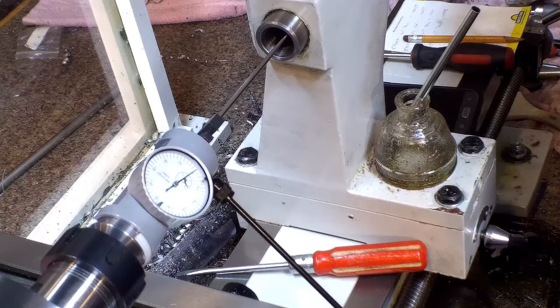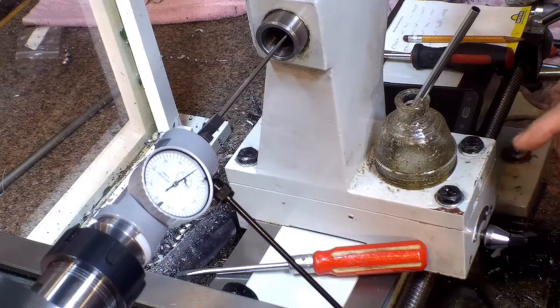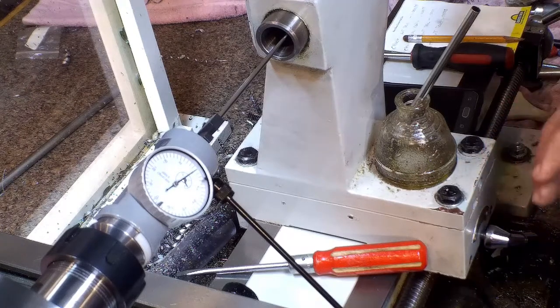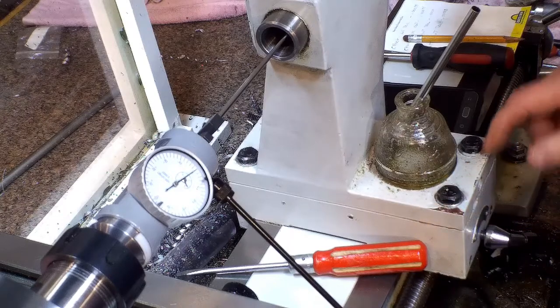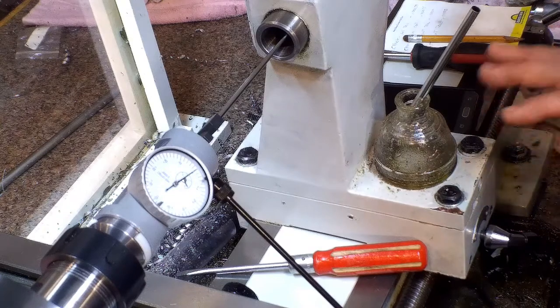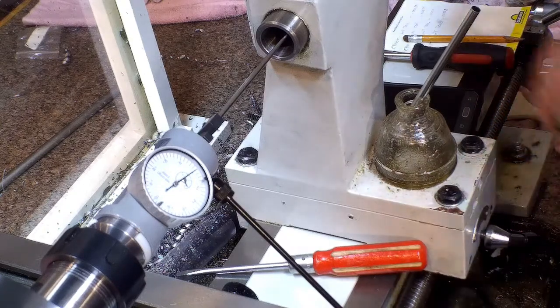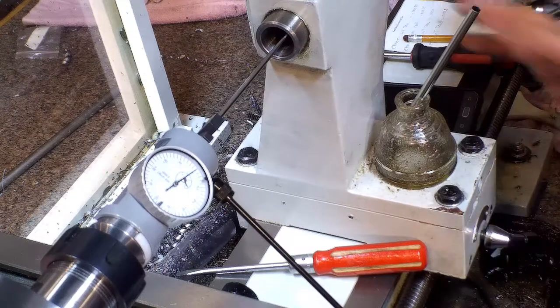I got it perfect yesterday, but Kyle gave me a tip and I wanted to see how it works, so I took it all apart again, cleaned all the sides, got all the adjustment screws lubed. I should also clean up where all the bolts are — there's still a lot of body filler — but I got it to where I could adjust it, move it, and tighten it without it moving. He made the adjustment using a coaxial indicator.